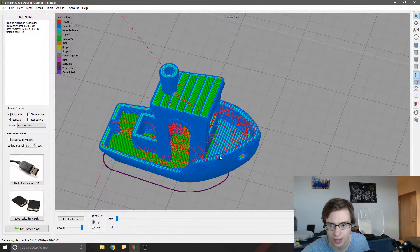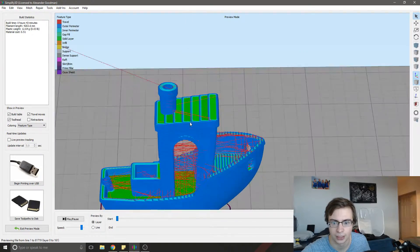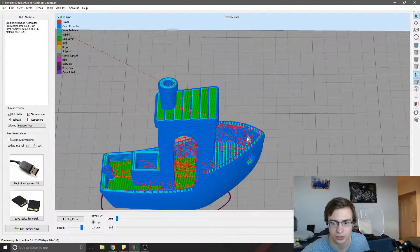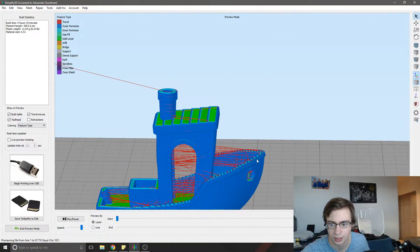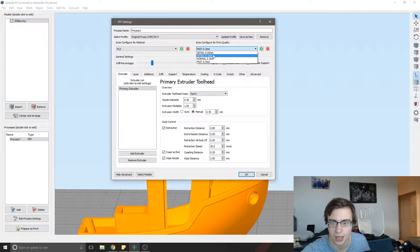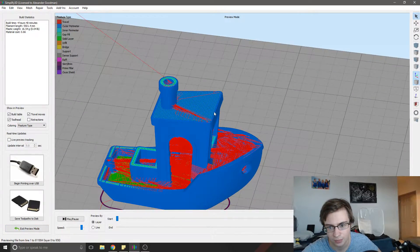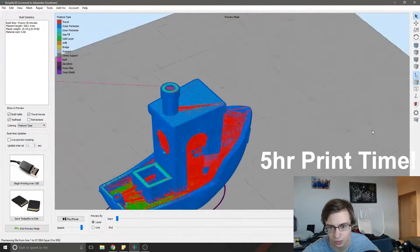The flat parts that are angled — like, this is all going to be flat, but up here this is kind of angled — so you're going to get this very visible stair-stepping effect, also here and also here. But if we go back and change this to 0.05, ridiculously high resolution — 50 microns — it takes much longer to slice, but the stair-stepping effect is almost invisible.